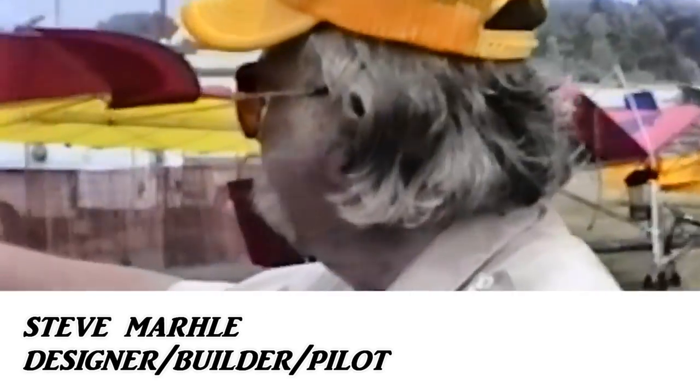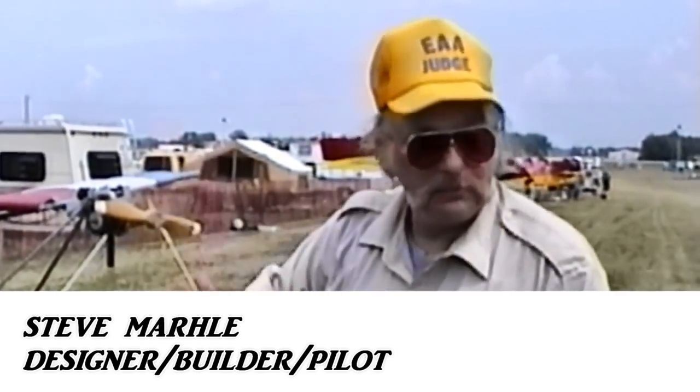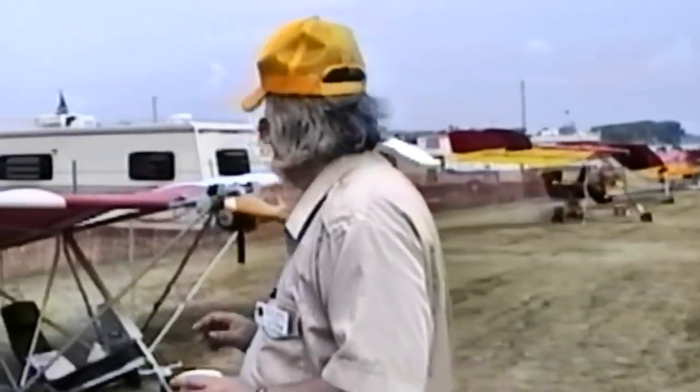It has served a wonderful duty. If you look at the sail, if you look at the cloth, the bottom sides look reasonable — no question about it, the color is presentable. But on the bottom, you look at the top and it's got that faded, dusty look. You start to see that in a stabilized Dacron sail, you write the sail off. It is done. It's over.